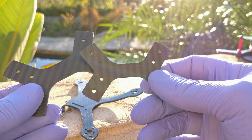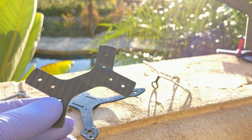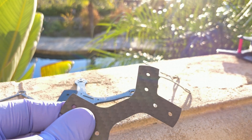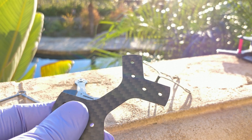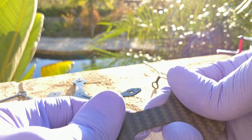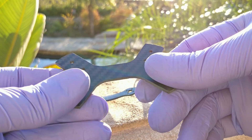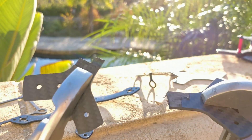These are two prototype bottom plates for the FlowRide - brace plates. I switched to the linear plate to give the frame more stiffness in the center section. I never wanted to worry about breaking the plates where my electronics stack is held. This other version was cut differently because I thought the arms would need more stiffness, but after testing I realized they didn't and went back to the linear version. Watch - I can actually break the incorrectly cut crosshatch version in my hand. But when I try to flex the correctly cut linear one, it just hurts my hands - two-millimeter carbon is this strong.